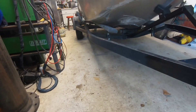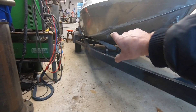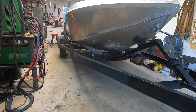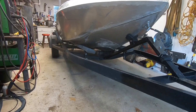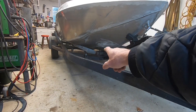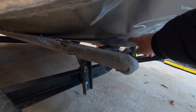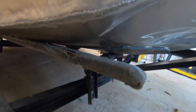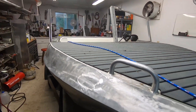I'm not sure how far forward I'm going to come. I may have to modify the whole front end and deal with that damage, though that part of the boat isn't really heavy in the water. The metal on the bottom is going to have to come up and stop at a certain point — I'm thinking it'll just match the UHMW, which kind of angles back and brings me back beyond my bend and damage points. But everything's holding up great — sat in the water all summer and didn't leak a bit.